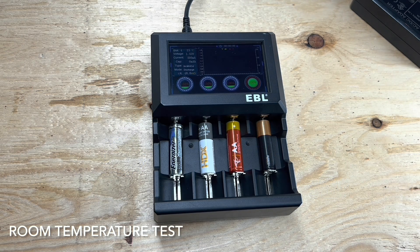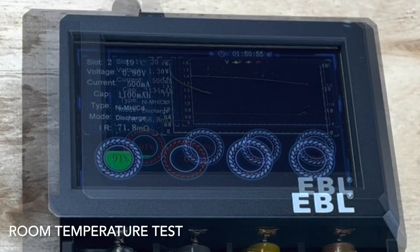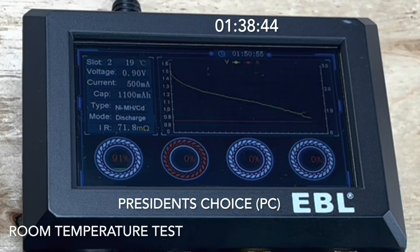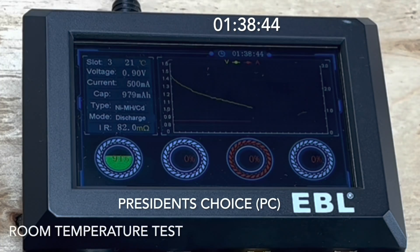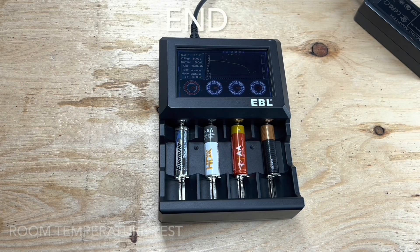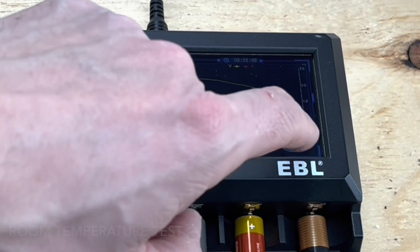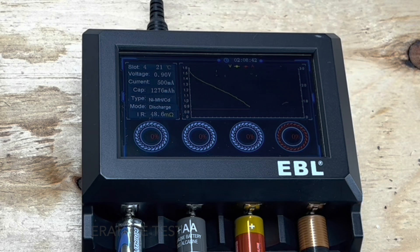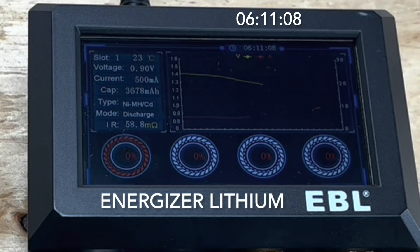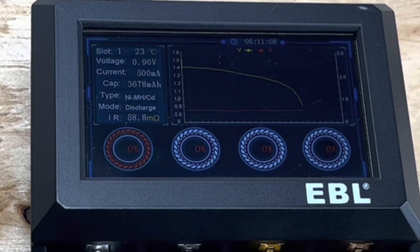In this test, we'll check an Energizer Lithium battery, a Home Depot house brand battery, a Superstore Loblaws PC house brand, and a top-price Duracell Optimum battery. At 3 hours, the lithium is still at 91% compared to the alkalines. The Home Depot battery ran for 1 hour, 50 minutes and 55 seconds. The PC battery ran for 1 hour, 38 minutes and 44 seconds. The Duracell Optimum ran for the longest alkaline at 2 hours, 8 minutes and 42 seconds. The lithium stayed steady on its output whereas the alkalines dropped steadily down, blowing the others away at 6 hours, 11 minutes and 8 seconds — almost 3 times longer than the longest running alkaline.